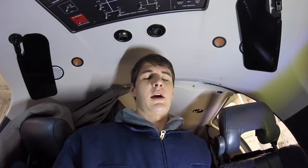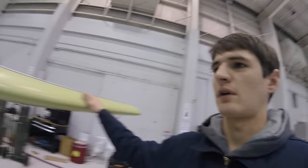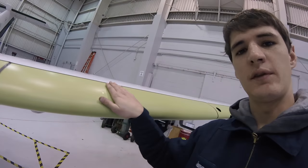Two nuts and bolts down here and then the seat slides right out. So I just printed off the reference for installing the boots — David and Luis can get started. The surface looks nice and clean. These boots are actually held onto the wing by 3M glue. Basically, line it up and glue the new boot in place.